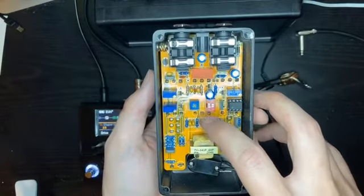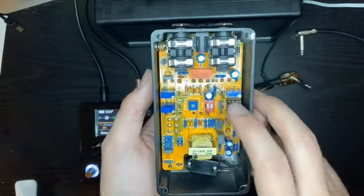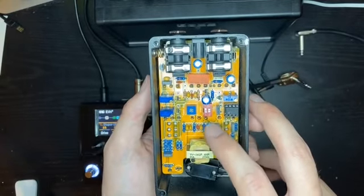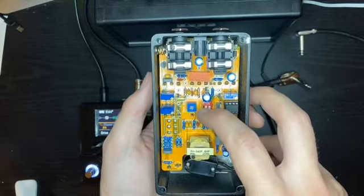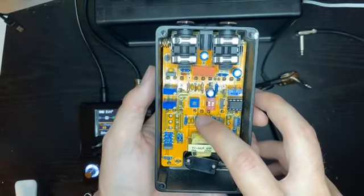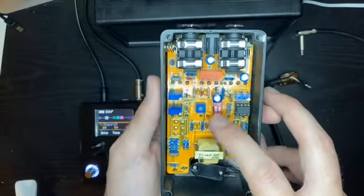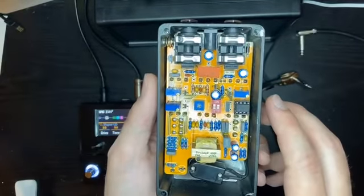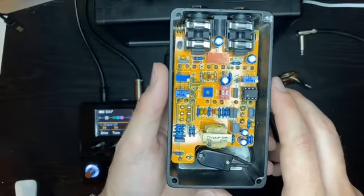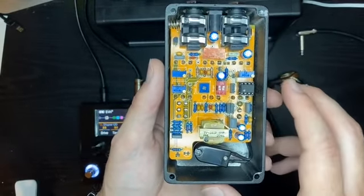Where he did have what was called a deep mod. It was just a simple 200 microfarad cap added across the third gain stage cathode resistor. Any amp nerds that are listening to this are like, oh my gosh, yes, because I studied amps long before I got into pedals. So sorry if I'm way too nerdy on this.